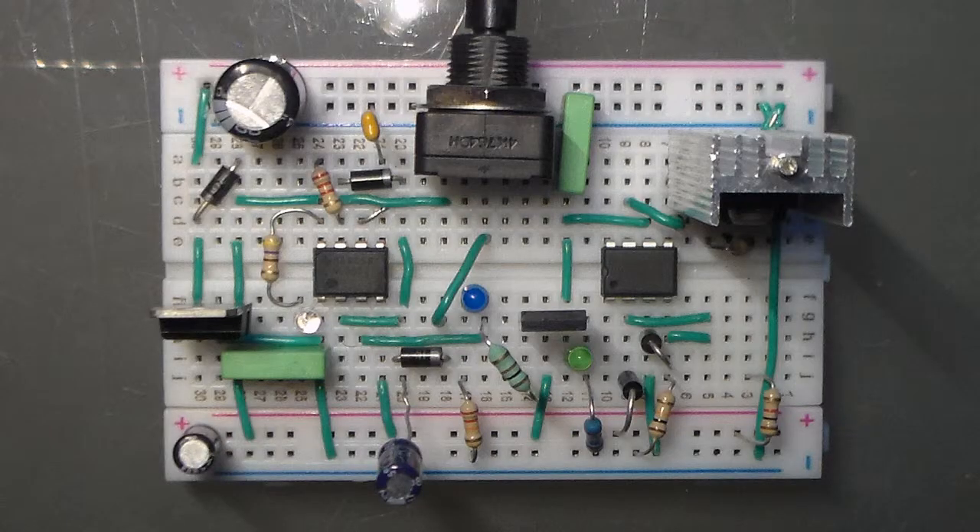The circuit is set up on the breadboard. The left IC is the 555 timer, using a 4K7 potentiometer to control the PWM, and it is driving a BD139 transistor. The BD139 transistor is in turn driving the gate driver, which is the MC34151PG. The MOSFET being driven is the same NDF04N60ZG as in the original Slayer Exciter circuit. All diodes are UF4007s, and to achieve the 12V power supply I'm using a voltage regulator, the LM7812.